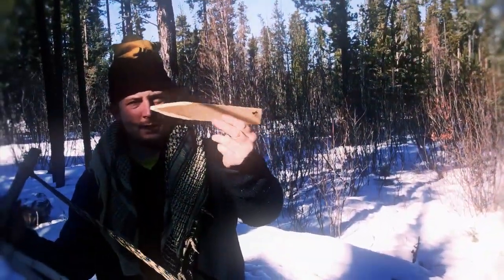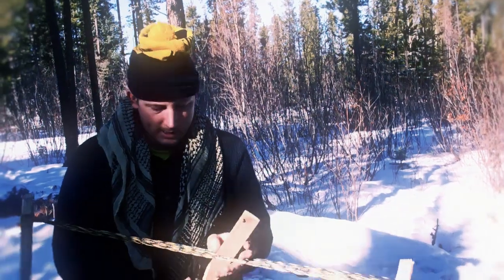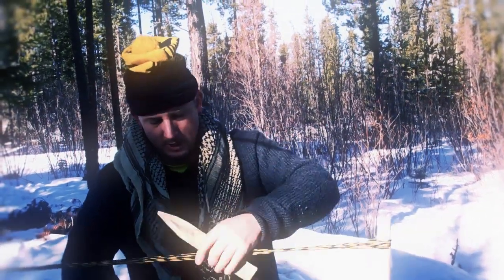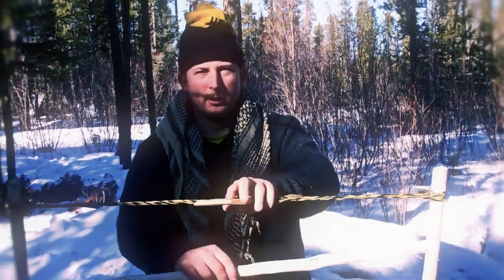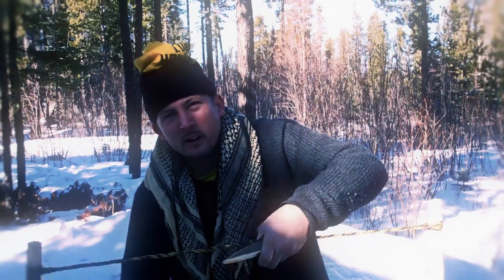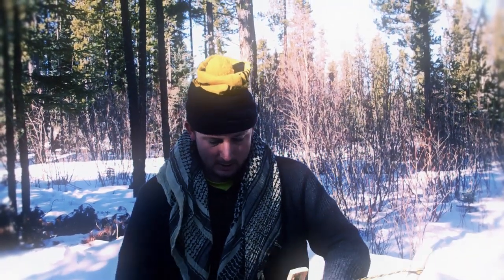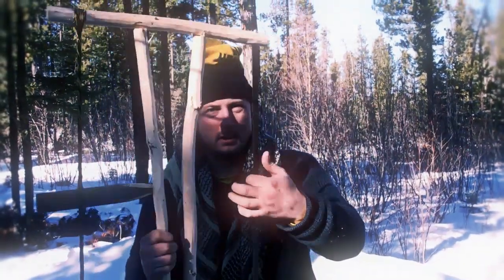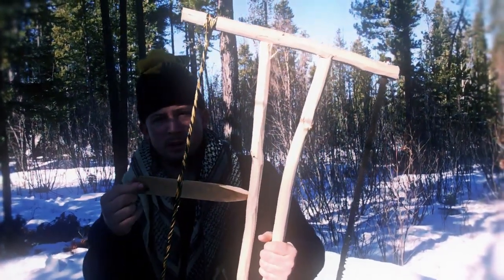So this is a little piece that's carved to a point — it's just some lath. To tension this, you just go through the center and angle it off just a little bit, then just start wrapping and it'll get more and more tense. The reason I'm doing this and having somebody film it is I built this saw, and if it blows up it should kill me and not somebody else. Let's see how tight that is — a little bit more I think. Then at the end you just angle it down. This is going to dry out and shrink overnight and then I'll have to put more tension on it in the morning.